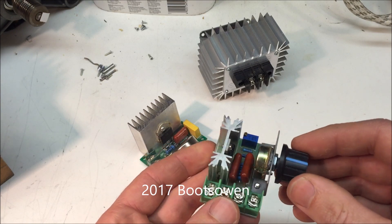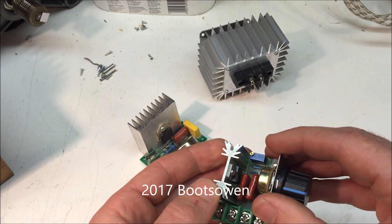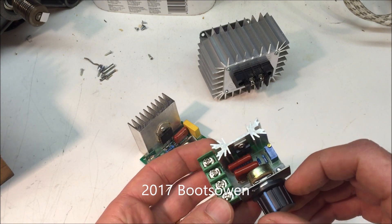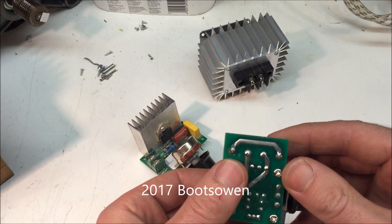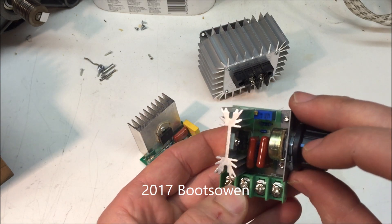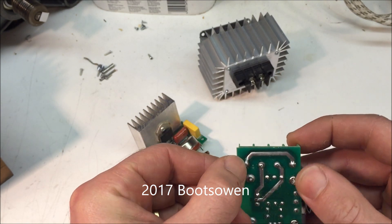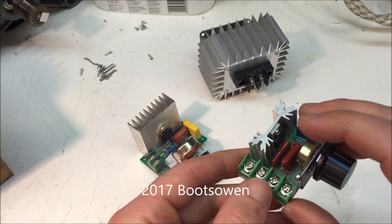This little one here should easily comfortably be able to handle 13 amps at 230 volts, you'd think, but I've blown a load of those up while trying to control washing machines. Whenever you get the shock load into the washing machine it just leaves it constantly at maximum value. As you can see from the circuitry on the bottom, you've got an input and an output — neutral here bridges straight across to neutral out, and you've got a live in and a live out.